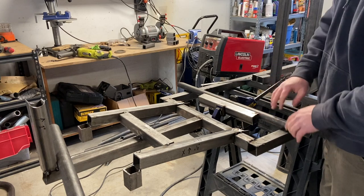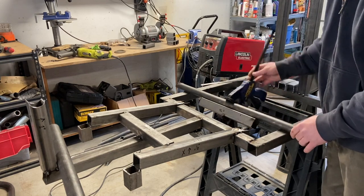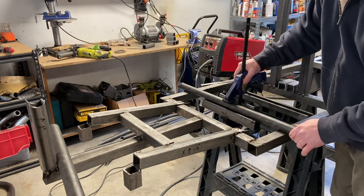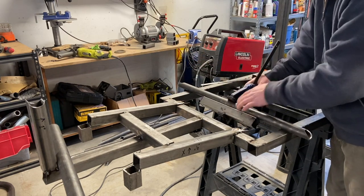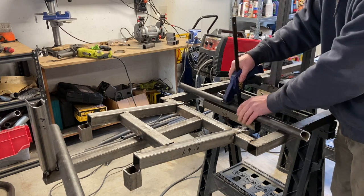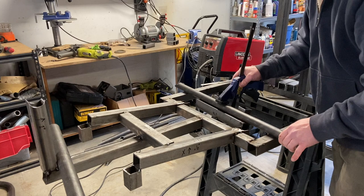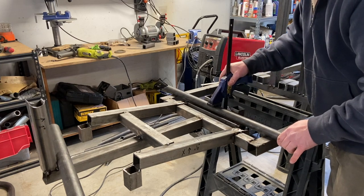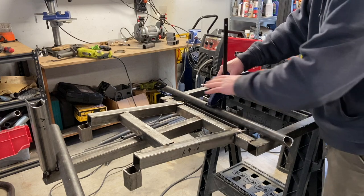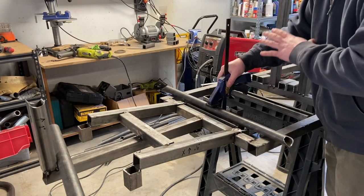I'm using just one of the long tubes. We know that these rails are the reference for flat bottom, and I've got my jig piece clamped to it. I welded these on the back so it's nice and flush and square with it. You can slide it into place exactly where it should be, and that way I know the floor is going to be perfectly square.